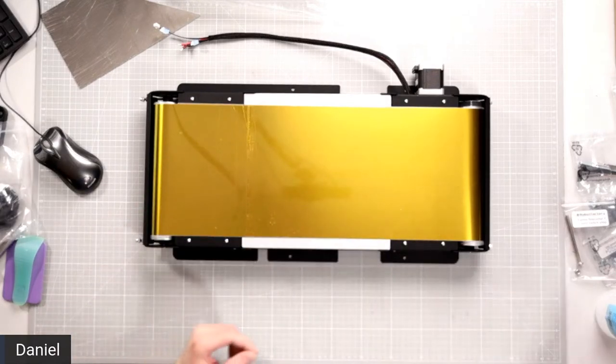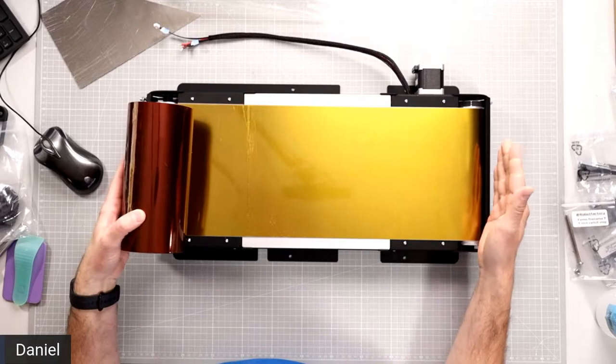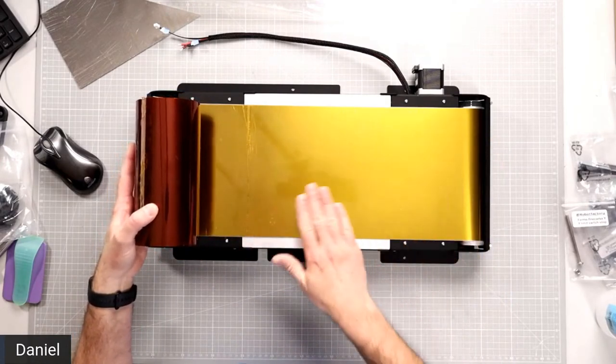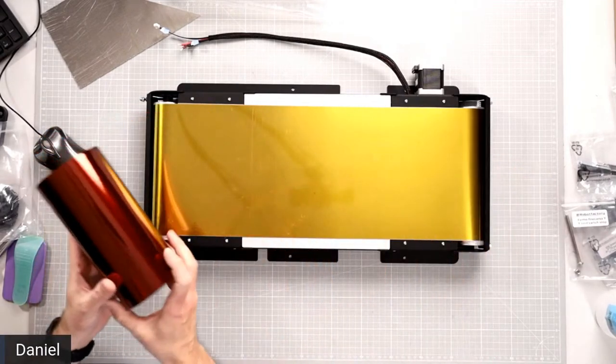And to apply this tape is actually not possible for one person, because you have to stretch it and then apply some soap water, and then you can stretch it over, get all the bubbles out, and then turn it a bit and repeat this procedure until you have done the whole belt. It's at least much easier for two people. So we did this yesterday evening and it has to dry, I think, 12 hours, you say. So we left it overnight, and now everything is dry, and that's why this is already prepared.